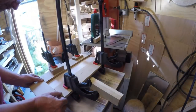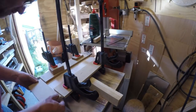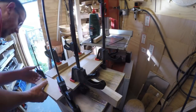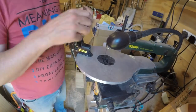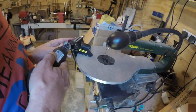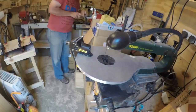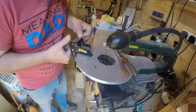Just to give an extra bit of support I put an extra piece of ply on the end — the other side of the saw — so that when the work cuts through it is fully supported. While the board was drying I decided to find some nails to use as pins. I found three different sized nails, ground off the really sharp point on the grinder, then used the rotary tool to cut them all to length, and then back to the grinder again just to tighten them up a little bit.